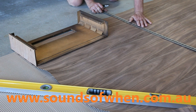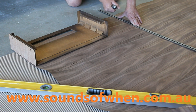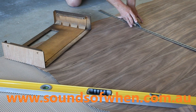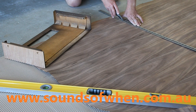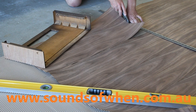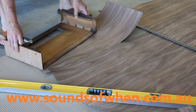Now the cross cut. What I'd do is start at the outer edge and work inwards, just so that you don't tear away from the direction of the grain. Cut in a little bit from one end and then go from the other end. Just do a light score first and then keep going over lightly so that you don't split the grain. Two or three times will be enough to go through. Just be careful when it flicks up that you don't split it, otherwise it makes it a little bit more difficult to work with. So now we have our piece.